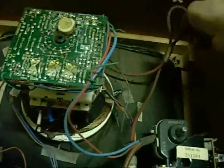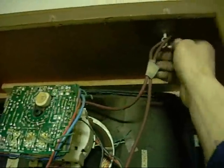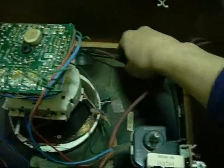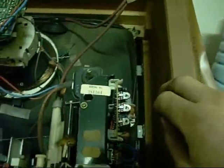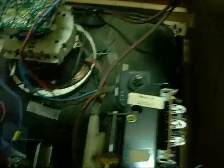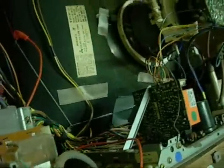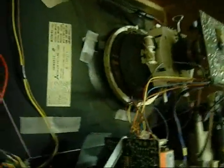Make sure your HT lead is clipped in properly and not touching anything that's grounded or other parts of the chassis. The only time I've been zapped by a television — and it was a full 25,000 volts — the lead was attached to the tube but it was very long and coiling, sitting back against a metal bracket in the housing which wasn't earthed. Stupidly enough I went and attached an earth lead to it and then went to attach it to an oscilloscope — POW! Apparently that's what happened, because I don't remember it. It hit me that hard. But it's survivable; I've never heard of anybody being killed by a charge from a tube, but it's not to say it can't happen.